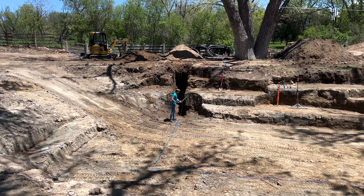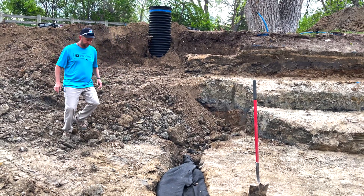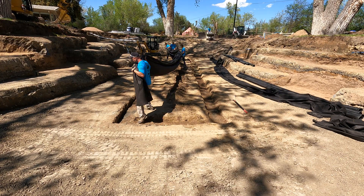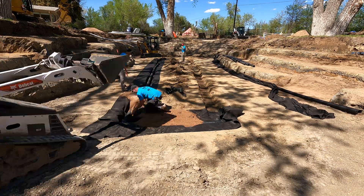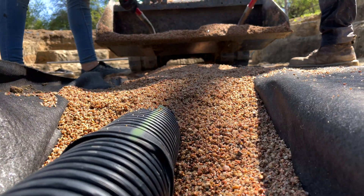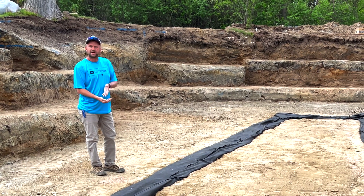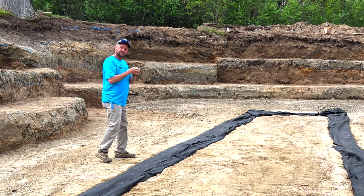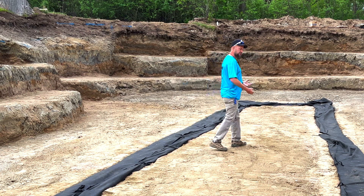This pipe goes down to the bottom of the pond, just a little bit lower than the level of this trench. You'll see from the video how we dug all this out. We put underlayment in to keep the soil from infiltrating the gravel. The gravel we used this time around is very small aggregate. We used a double-wall corrugated pipe with smaller slits in it. Normally I would use half to three-quarter inch round gravel — not angular stuff. I like the round because the spaces are bigger between the stones, which allows it to operate properly for more years without clogging.